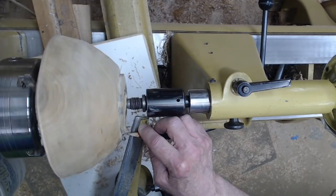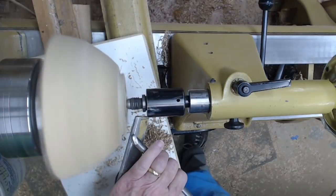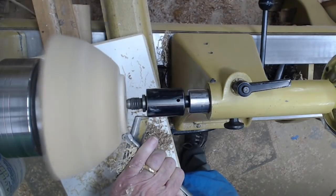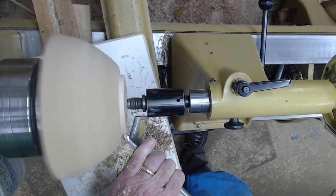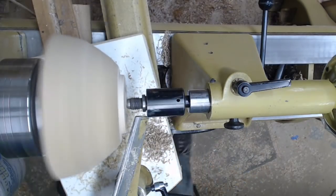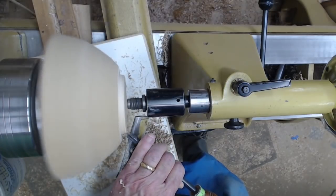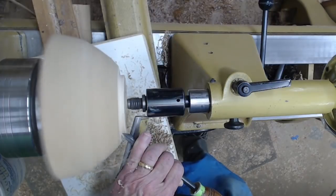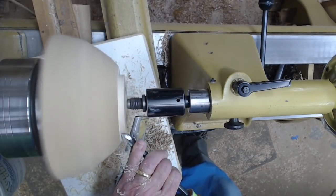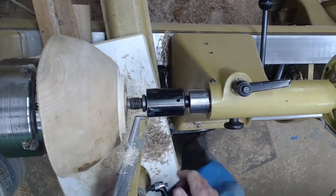Pretty close — it comes in nicely. I'm going to use a bowl gouge to start the cleanup process, then switch to a detail gouge to better do that profile — this just works better for me. Slightly bring it in, bring it back, make sure the chuck will mount on the outside of a flat area, and then just nip that corner. So now I've got that tenon in good shape. Now I'm going to go ahead and finish the outside of the bowl.